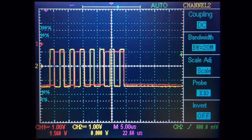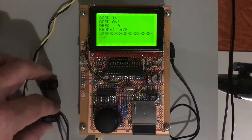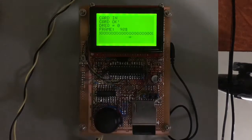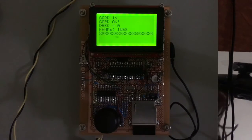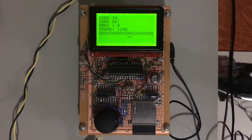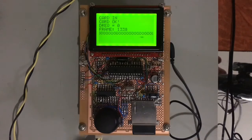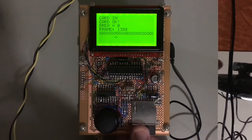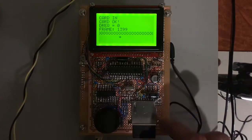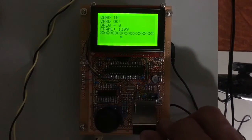Here's what the SPI clock and data lines look like sending the byte value 0x53. The row of X's on the screen represent data — I'm printing out everything but replacing anything that can't be represented in ASCII with an X. With a 32-byte buffer, you don't get much time playing after pulling the SD card out. I could probably do something to resume when you put it back in, but again, it's pretty early days.